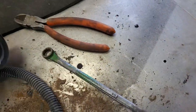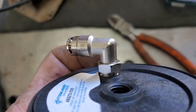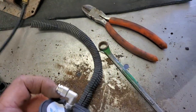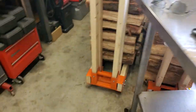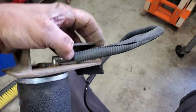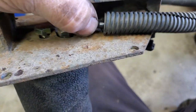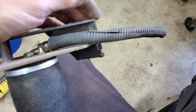I'll put this one up — got it indexed pretty good. I'll tighten it up a little bit more. There was Teflon tape on it already, but if you don't have it, please put it on. The new one is good — even though it doesn't have a barb, these pivot easy. The old style that doesn't have the pivot — the moving joint — you have to index properly. This one, we don't have to do it.